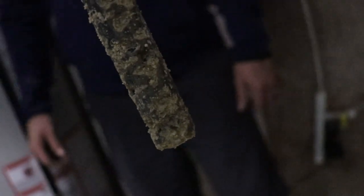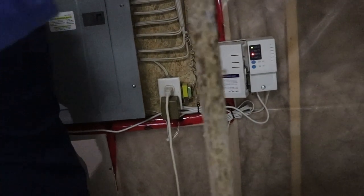So this is what mine looks like, and it's kind of what we figured afterwards because I don't have the hard water, soft water thing. So as you can see right down here, it's kind of started eroding the bottom quite a bit. I don't know if it's hard to see, but you can probably see there a bit. It started to erode the bottom, but if it's like this, it's time to replace it. And I'll show you the good rod.